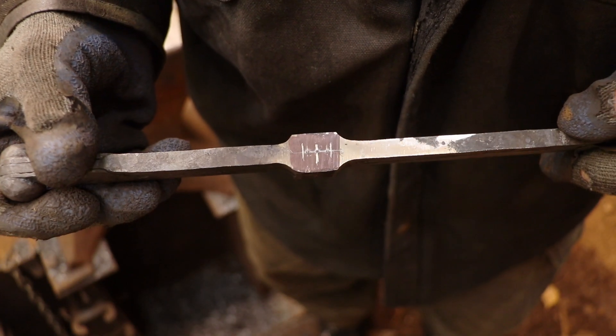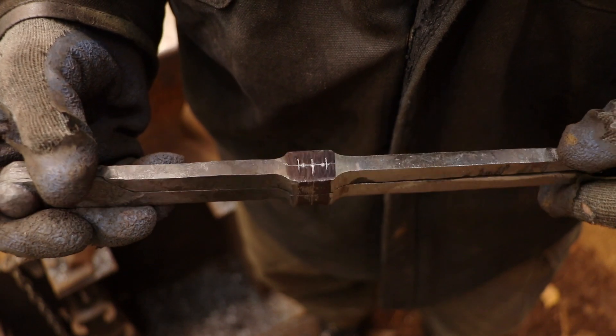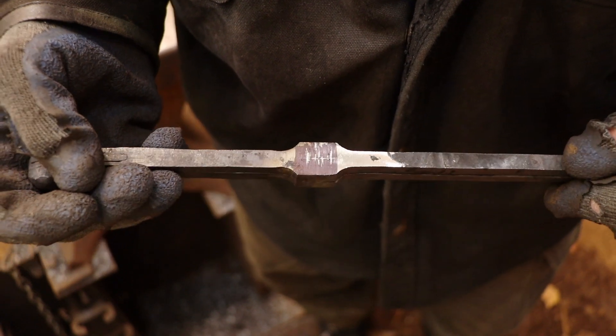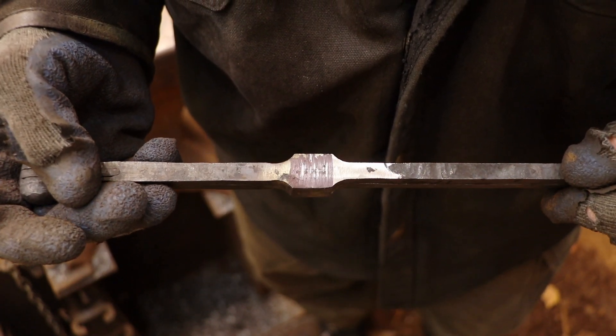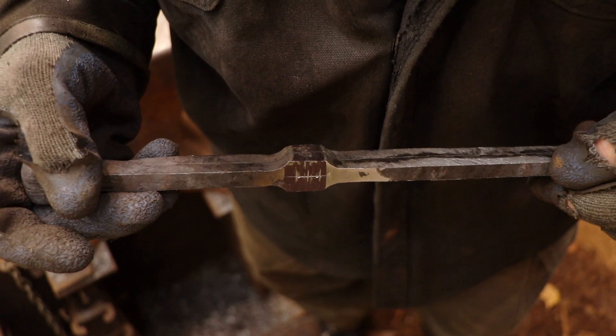This curve section needs to pass through both of the divider legs and I have that location marked out here. I'm just going to be drilling out and cutting away the material the way I always do, and the final fitting will be done with a file.